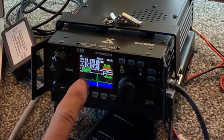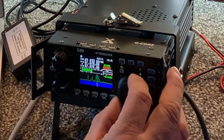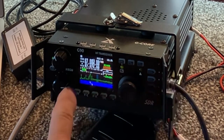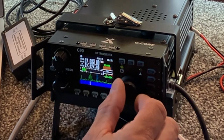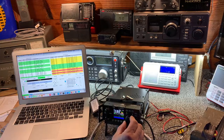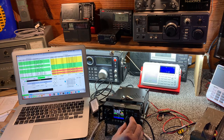Let's see when it stops what the noise level is. Noise level is, well, we could move off band here. Noise level's about a 3, bumping up. There's a little bit of static noise. In fact, let's listen to it. Right, so you can hear the static. So good signal to noise ratio. Got a 10 over, a little over 9. A strong, strong signal coming in.